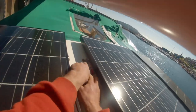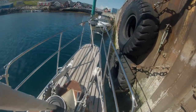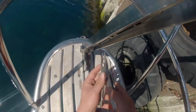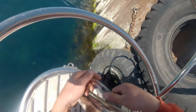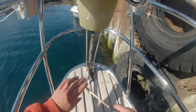I'm going to pop these hinges and angle this one more towards the sun to get a little bit more out of that. Okay, so we're going to loosen the headstay. I've hit the turnbuckle with some PB Blaster just to make it a little easier — PB Blaster is amazing stuff for loosening up seized bolts. Next step I'm going to take these pins out. Looks like I'm just going to have to take these bolts off and remove these so that I can turn the turnbuckle.